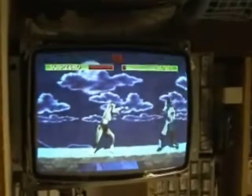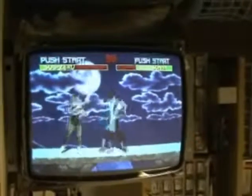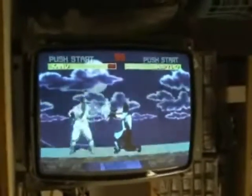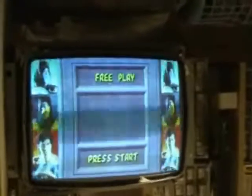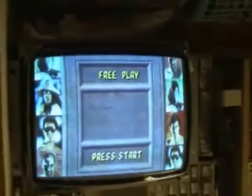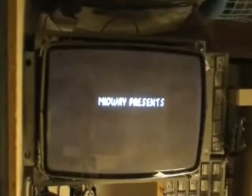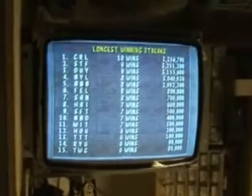As you can see, it's running just fine. I've had it running over 10 hours now — looking just fantastic. All the colors are adjusted to this tube, so he will have to readjust everything when he gets back into his game. As a suggestion, as your fuses and stuff are blowing in your cab, power up everything and make sure they're not blowing before you put the monitor back in. That way you can determine whether you still have an issue in your cab or if it was because of Q901 and the insulator not being reinstalled properly. Hopefully this fixes your issue — it's running just fine and looks great.